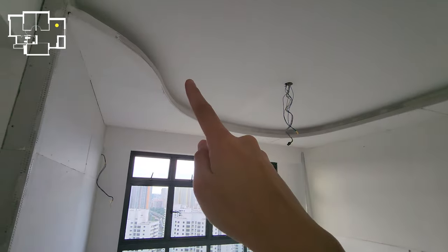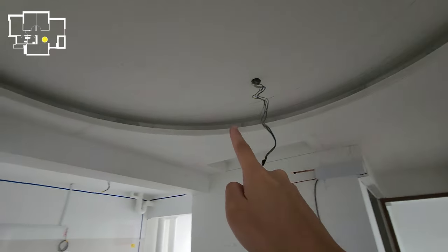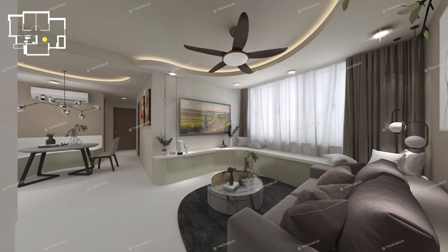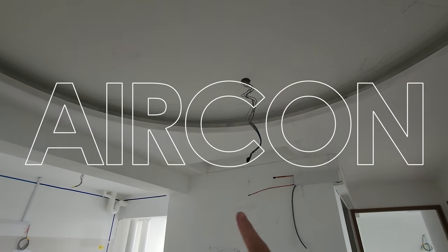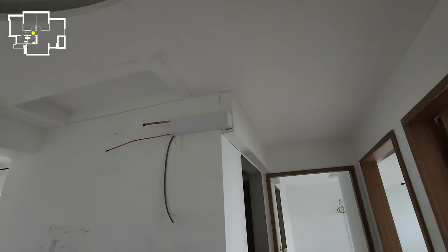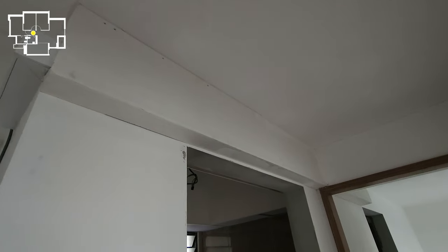A curved false ceiling flows from our living to dining room. Before you leave a comment saying that it will collect dust, we weighed the pros and cons and still went ahead as we felt that the design would bring character to our otherwise monotonous home, and cove lighting would really soften the mood. You will also notice that we have an aircon point catered to the specifications provided by the aircon installer the day before, and also our aircon trunking is now encased in an L-box that flushes all the way to the master.